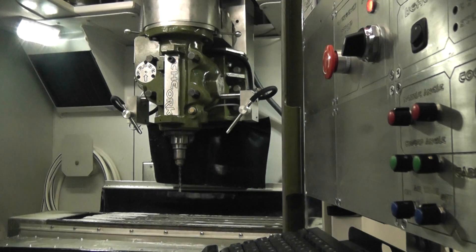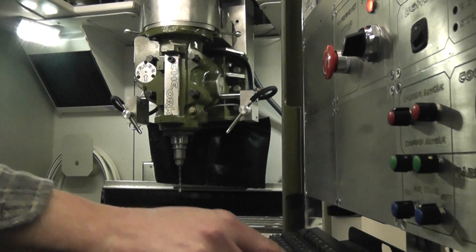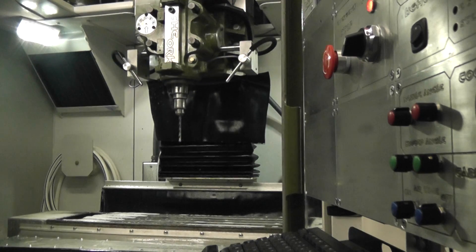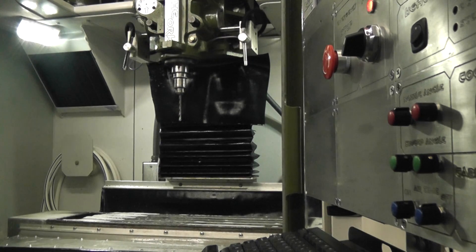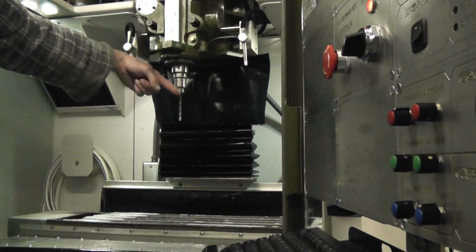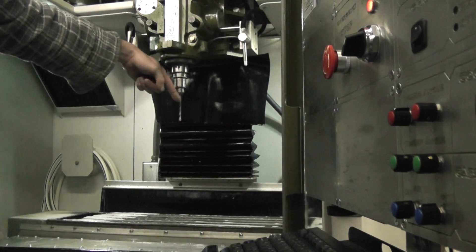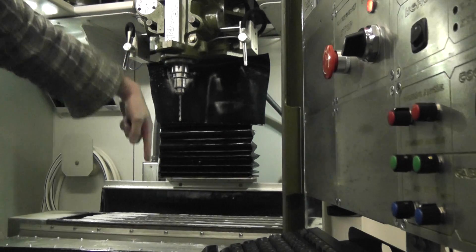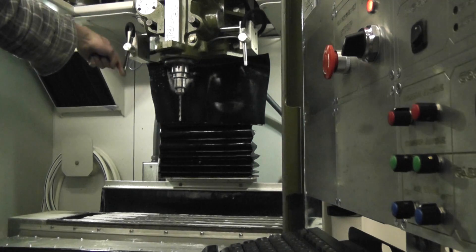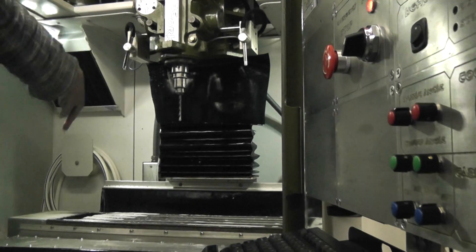I'll demonstrate a tool change here. It starts from the bottom position, sweeps up and down about three times, and on the fourth time down it turns the air valve off so the air isn't blasting directly on the table. It shuts off early on its way down and then parks. I might adjust this angle out a bit more so it's shooting off to the sides.